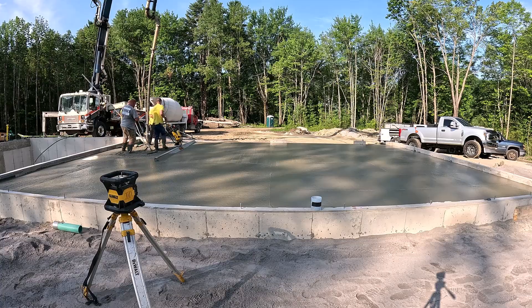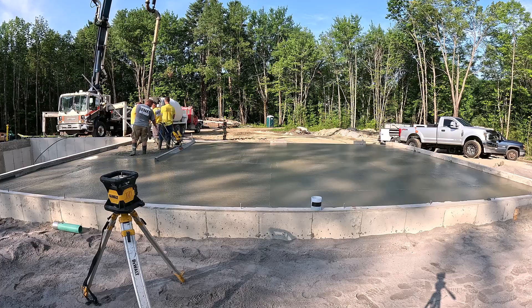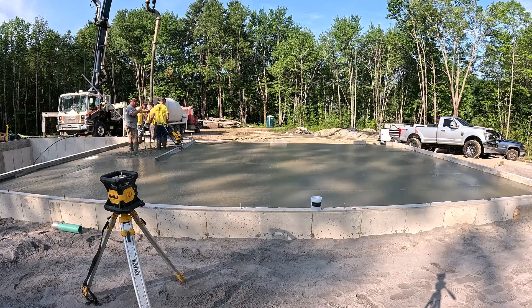That's me running the power screed right there. Let me know your thoughts on how we attack a 36 by 28 garage like this. If you want to learn from us, join the Concrete Underground below, and leave a comment if you've got any questions. The mix design is a 3500 psi with fiber mesh and water reducer — our basic floor mix we use on all our pours except the exterior finished stuff. We're just trying to get a little bit more concrete in there now that we're down to the very end. We don't want to waste it or have to shovel it out. Thanks for watching guys, we'll see you on the next one.